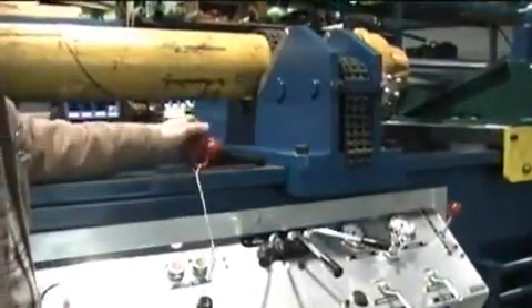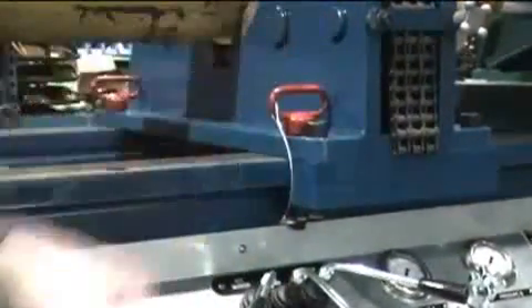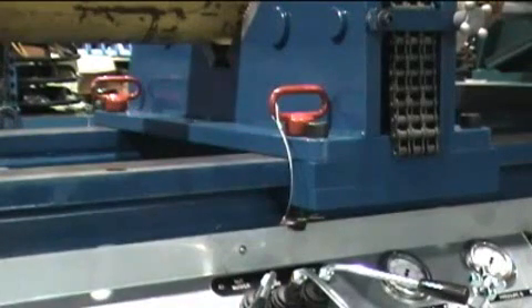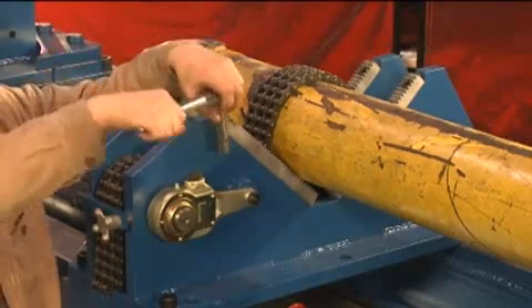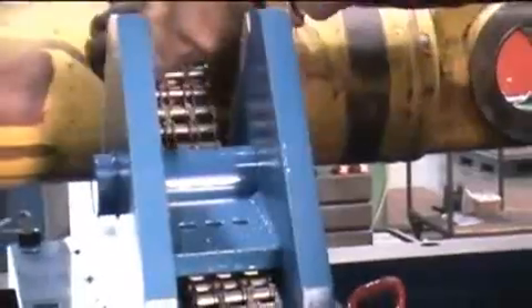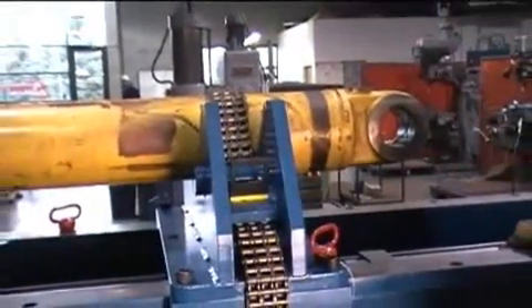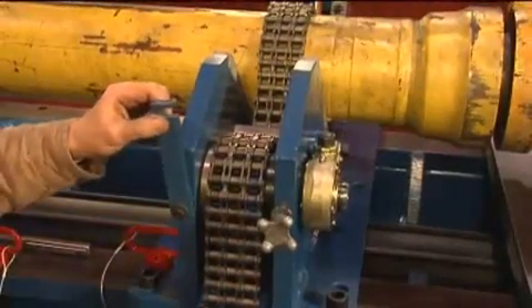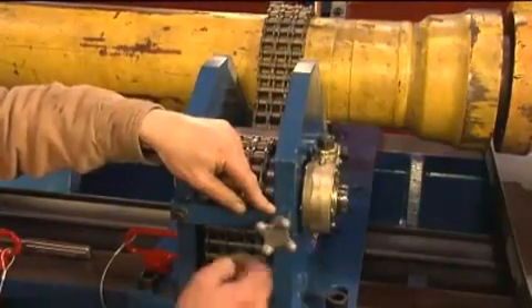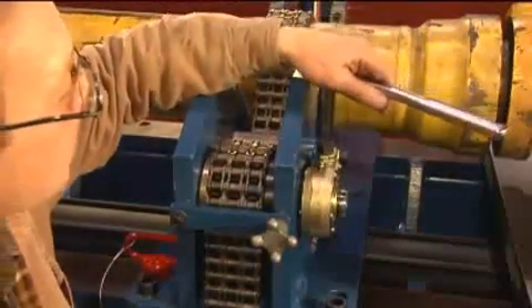When using the triple-row chain vise, be sure to use two locking pins, one pin per rail, to square and center the chain vise to the disassembly machine. After the vise is square, secure the vise to the table with the L-brackets. This will also act as a guide for setting the adjustable cylinder supports on the roller plate. The heavy-duty chain vise is supplied with 10 feet of standard No. 60 triple-row chain and a three-finger lock. This finger lock is used to adjust for excess chain. Only use as much chain as is needed to secure the cylinder into the chain vise. If there is too much chain on the tension side of the vise, there will be a problem with putting the chain under the tension sprocket. Always use the tension strap to keep the chain engaged in the tension sprocket.